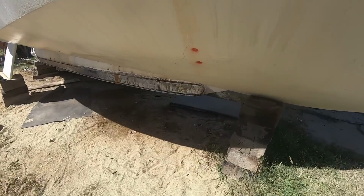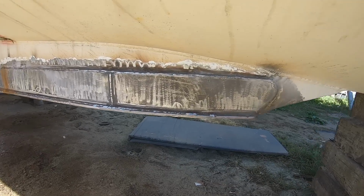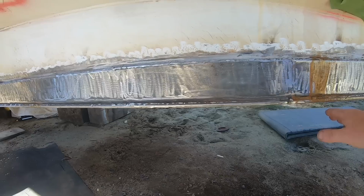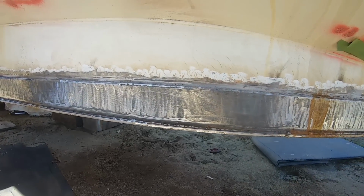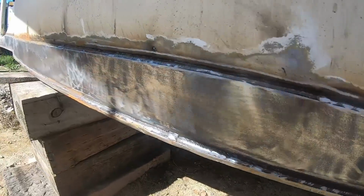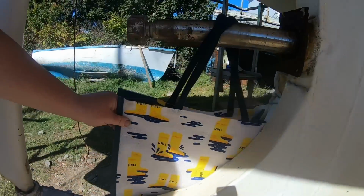And this is our new keel base. I'll go all the way round, which I wouldn't normally do, but it's just incredible. So the new keel base itself is 8 mil thick the whole way across. And then this is 100 mil up and 6 mil thick steel all the way around. So I'll go under here, all the way around, all the way to the end.